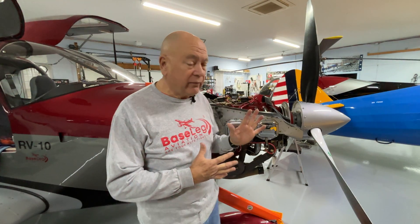After that, it's a very thorough preflight. We've already run the engine, so we put all the cowlings back on. One thing that hasn't been done yet are the brakes. Brakes on aircraft, unlike your car, need to be worked in — they need to be seated. For those who are experienced or taking an experienced pilot in the additional pilot program, I usually set those brakes on the taxi out, checking them on the way rather than doing long ground runs. I'd also recommend that for first flights, if you have wheel pants, leave them off — especially with a new engine. That extra drag requires more power, which is what you want for break-in at higher power settings, and it also helps the brakes cool better while taxiing since the brake pads will be getting hot as they seat.